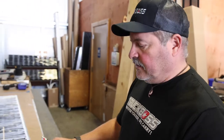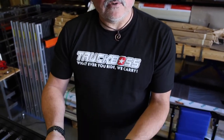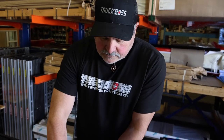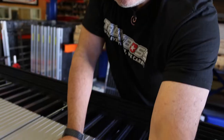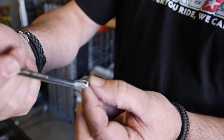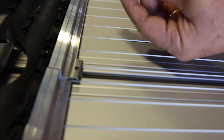We're ready for the carbide protection kit — all the hardware you need will be in it. When getting ready to install, plastic T-nuts go into the capture channel that your screws will bolt to, so just insert those into the plastic capture channel. The dowel we talked about earlier shows where to put the T-nuts so they easily line up with the carbide protection kit. When installing the clips for the CPK kit, there is a long end and a short end. Put the short end against the aluminum extrusion of the CPK kit. You can use your screwdriver to move those around.